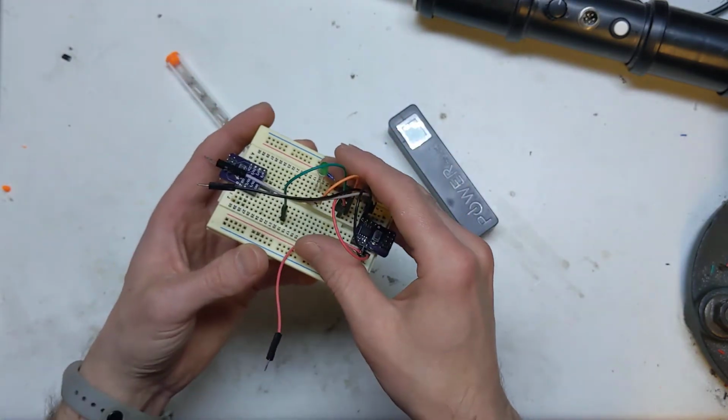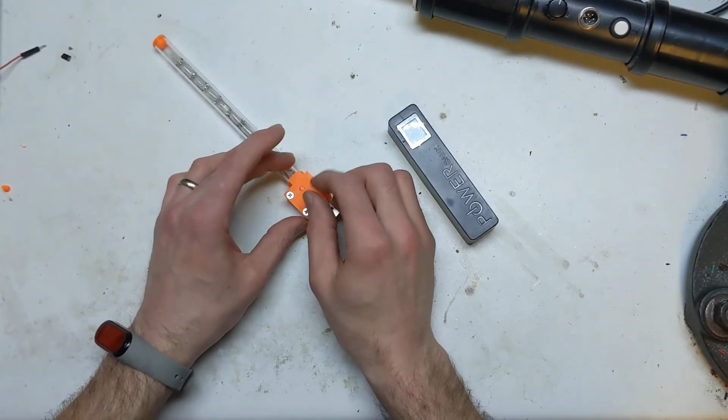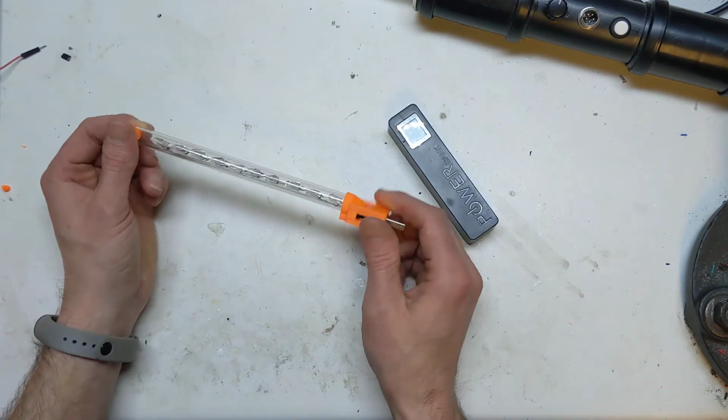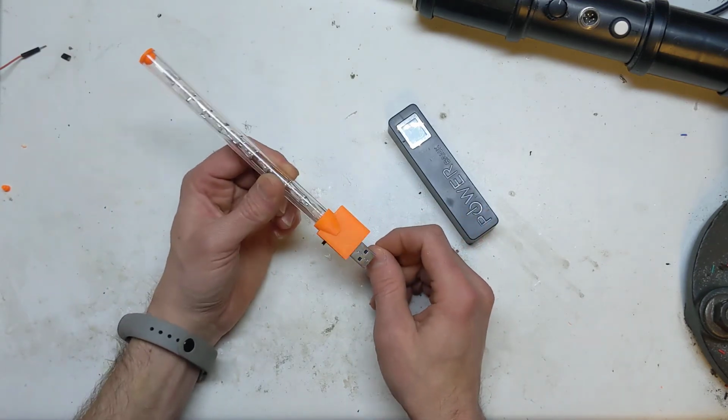So I get all the code ready on this. When it's done, it's finished. I solder the chip on first, then burn the bootloader, burn the code, and then build the rest of the circuit, and that's it. It's done. Hopefully there are no other bugs after that. But you know, there always are bugs.